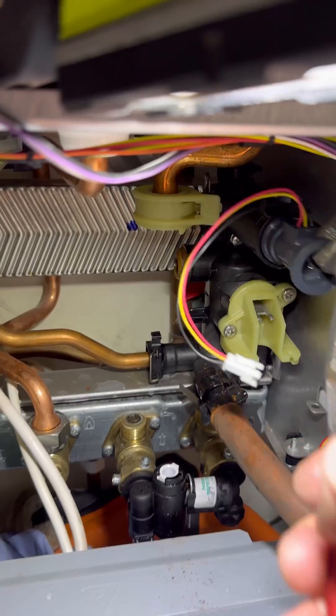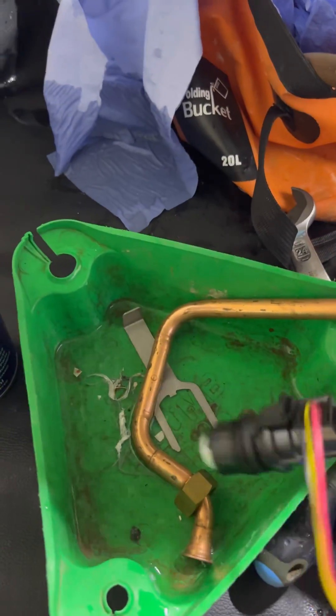I'm not going to show me taking the plate out because I've done it before, but I always take the pump out because I guarantee the flow adapter will be broken as well. There we go — I always carry one of those; get that changed. That can contribute to poor hot water also.